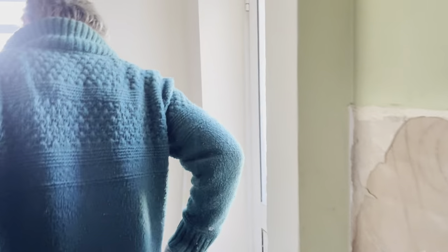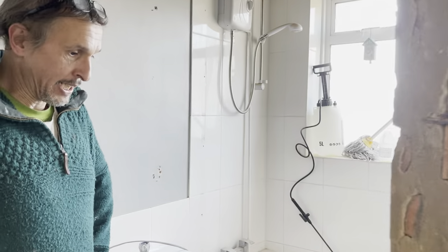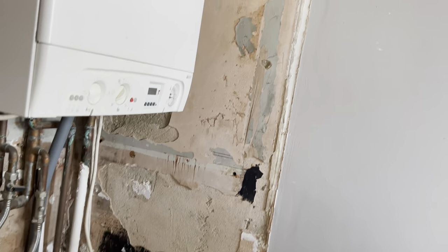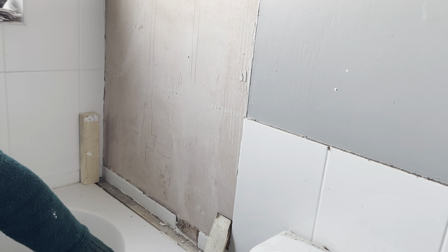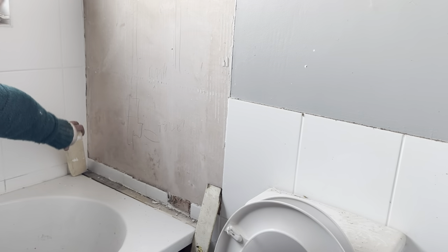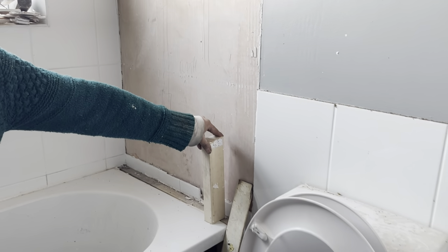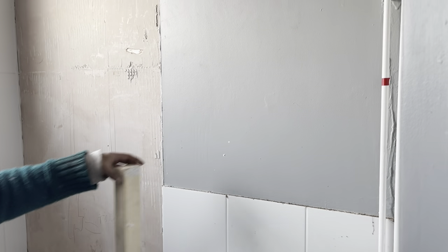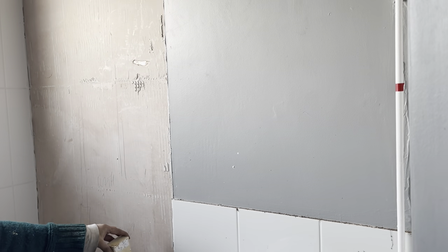Don't say knock down the wall and extend the kitchen — already been through that! We have our small bathroom at the back of the property. Historically this used to be the outside toilet, as you can see from where the waste used to go. The changes here: I'm going to have a 1600 bath rather than a 1700, put in a partition wall, a mixer shower, and a back-to-wall toilet so everything is enclosed inside the wall with no visible pipes whatsoever.